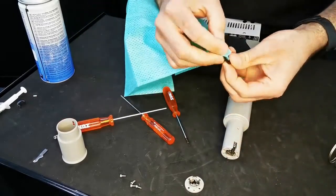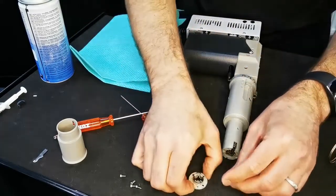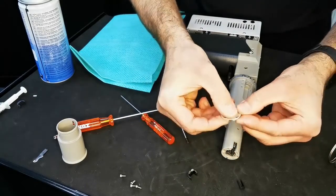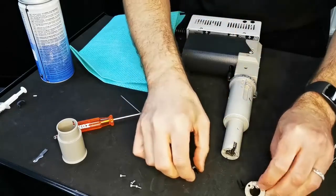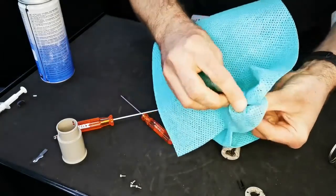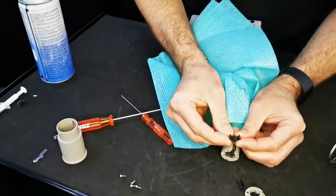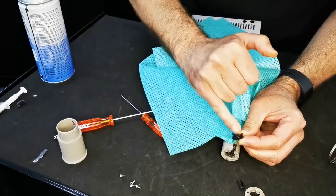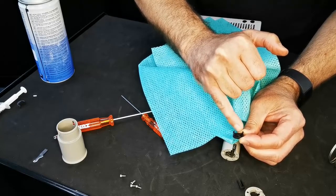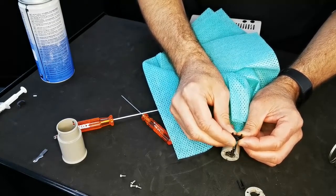The next part is the glide disc, so that the blade holder can slide up and down freely. The next two parts are the end cap — which should be inspected for any damage or wear, especially any burring — and the blade guide itself. On the blade guide, you may notice there is an X, which is a wear indicator. This X should be visible at all times. If there's any indication the X is wearing, even on any of the four corners, it's time to replace it immediately. If not, you can damage the tool beyond repair.